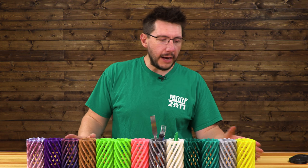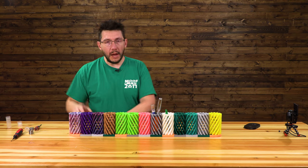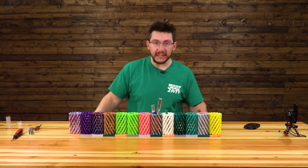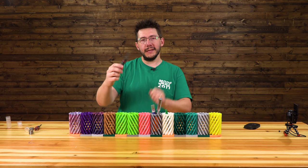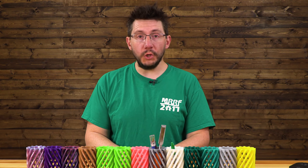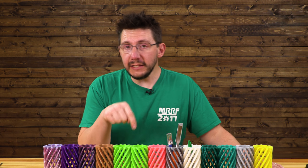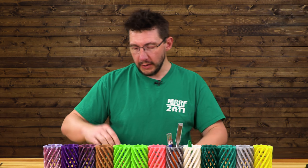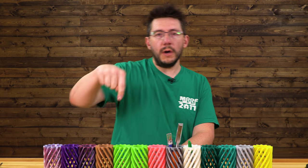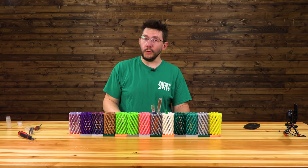Great design on this. I know some people have said that you may need to put spacers under the bearings just so they spin easier, but they spin just fine. The ColorFab, the Nylon G, the PolyAlchemy FX, and the Filamentum filaments for the base all meshed together just fine. And for the ones that didn't, I was able to take a burr removal tool and make them all fit. It's not always sunshine, rainbows, and unicorn farts. Sometimes prints fail, and in the case of this, a lot of prints failed. This isn't the easiest thing to print because as it prints this helical structure, it has to have the nozzle hop around to each of these little threads as they go up — just over and over and over. So it's a massive amount of retractions. It is a long time to print. So let's take a look at some of my failures.